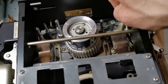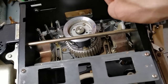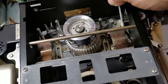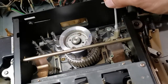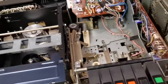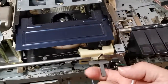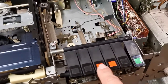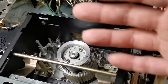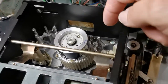I don't know why this video has not been made yet — this format was released way before I was born. I'm going to make a whole lot more videos regarding this format. Now since this plastic part is here I'm not able to get the entire capstan, but there's a very easy way. I go ahead and turn on the machine, move the slider to the right — you always have to do that — and press play. It doesn't do anything because there's a sensor there, so I place my finger on it to activate the machine and make it spin so I can get to the part I couldn't clean before.